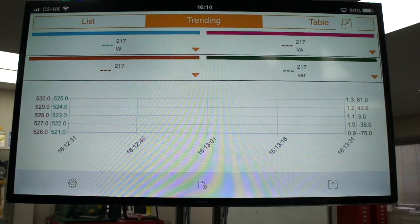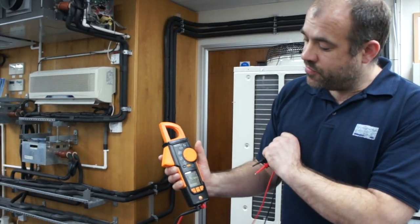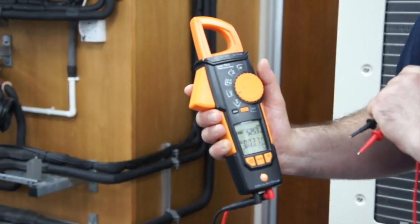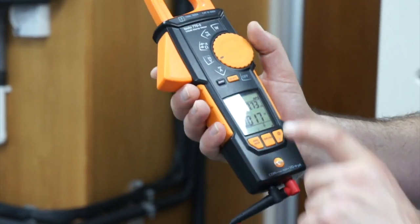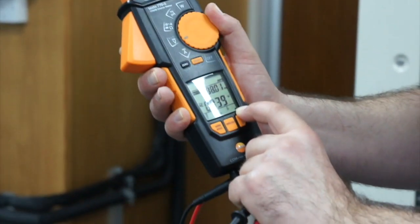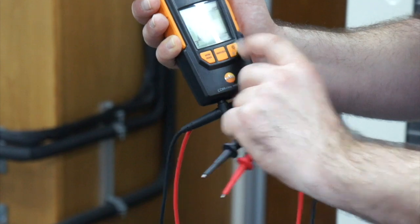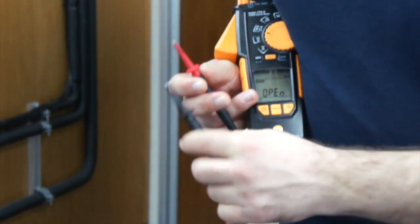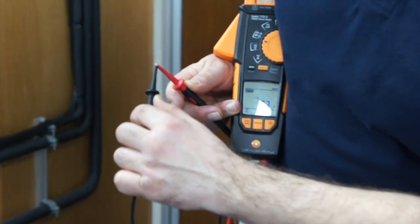You can even show this on your full-size HD screen. A few extra functions: we have degrees C and degrees F — centigrade and Fahrenheit — and we can attach probes to take temperatures. We also have a bar along the bottom which, in resistance mode, shows the range we're actually in. If I put those two together quickly, it drops down to show we're in the up-to-600-ohms range.